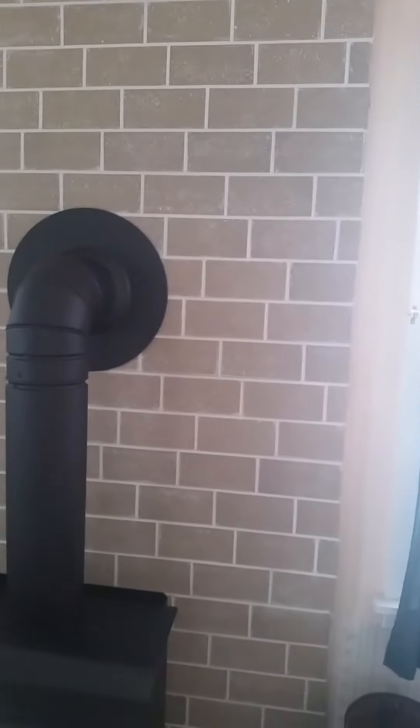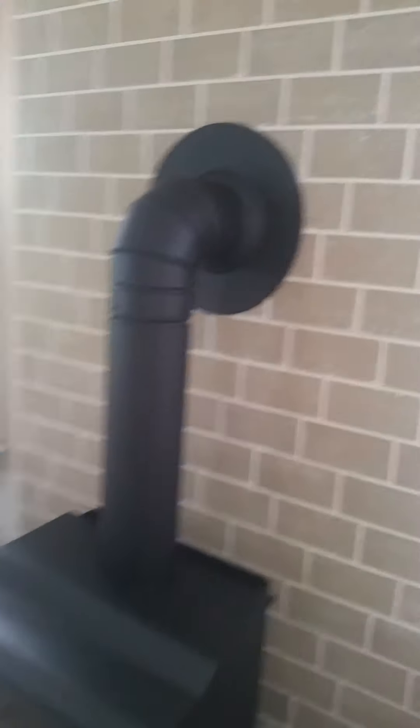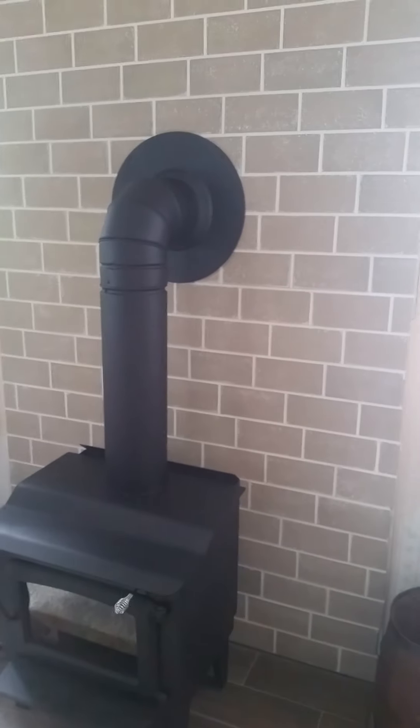One more thing you'll see in the pictures in the third video — there's a strip of plywood and cement board added to the wall. We wanted the whole wall to be centered between the windows, and since the studs weren't in the right position, we added this strip. That combination of materials brought it out an inch, and we used what we had on hand rather than buying something separate. That's pretty specific to my house. That's the inside — I'll post another video on the outside.